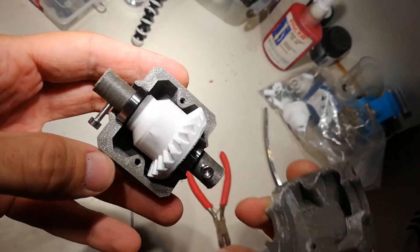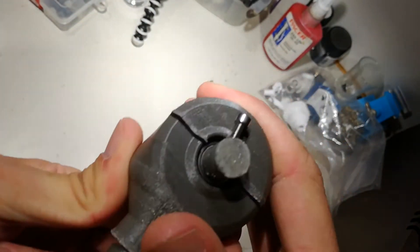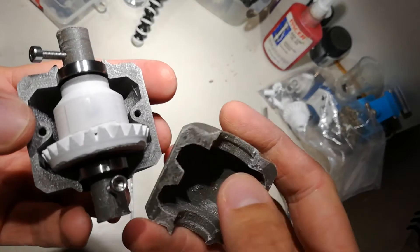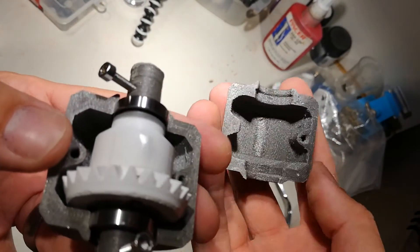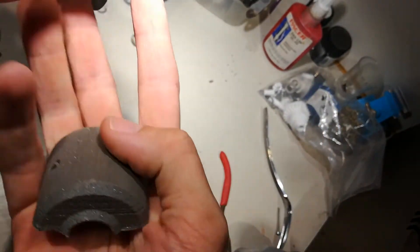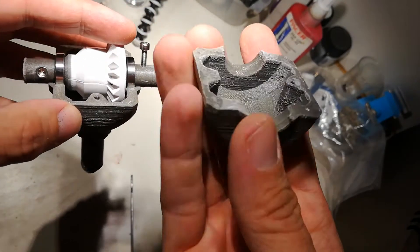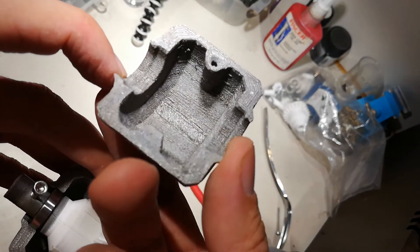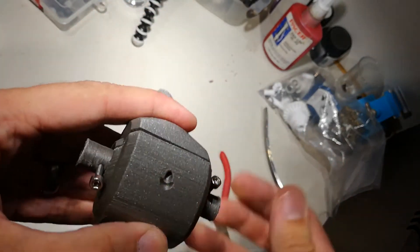Now I also printed the cover. I've got a little bit of warping on this unfortunately — you can see it doesn't close quite right. Also my tolerances were too tight on these since these are overhangs printed without any support — I probably should have left a bit more tolerance. This one prints vertically, sitting like this, but this one was forced to print this way around so it's not quite as good. Probably need about half a millimetre of tolerance there or something. Should be good enough.